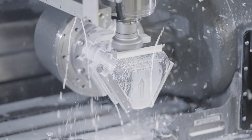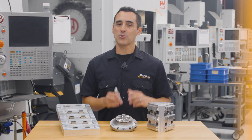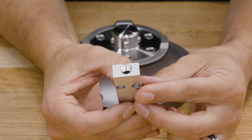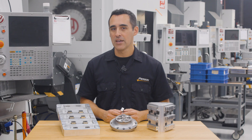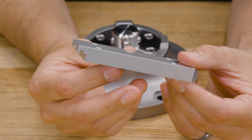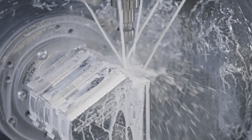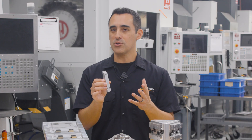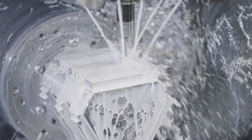Let's talk about this part and I'll show you why it used to be a total pain to produce. The part we're talking about is what we call an inlet bridge. It's the interface from the front of our vacuum chucks to the inside. It has one op for this face, another op for the bottom, and then — this being our longest size — we opted to drill through from both sides: op 3 and then op 4. We do this so that the drill doesn't walk. Shorter parts, we do it in one shot, but this one we do it in two.